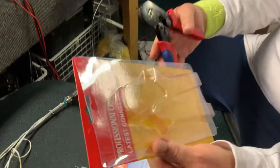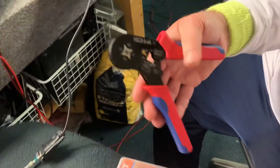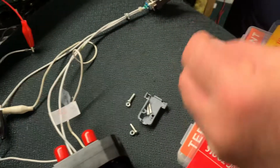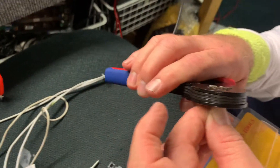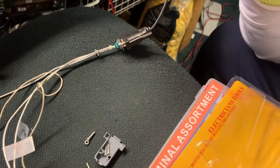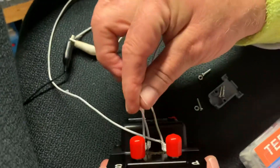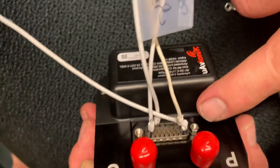We got this crimping tool — it's a cheapy — but this is the tool we used: it's a HSC 86-4A, and this is what crimps these connectors. You just take the ends of the wires, insert the center conductor, put it in there, and crimp it. Now you have a nice little connector, and you can slide it onto the post. You can see in the back they've been crimped — they changed shape when crimped.